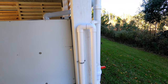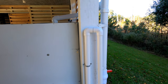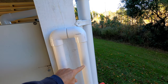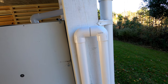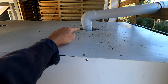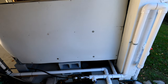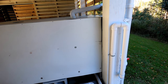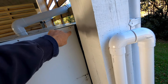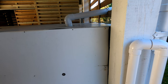I actually have four overflows total — two on each side of the back of the house, duplicated on the front. One thing I've noticed is during heavy thunderstorms, the amount of water coming through here can't keep up with the gravity-driven flow, and water will start coming out the top. For that, I really don't care — it just goes onto the concrete which is made to get wet. But if that's a concern and you want to keep up with high flow, I would drill a three-inch hole in the top side of the tote and drain directly in — that will certainly keep up with any heavy storm flow.